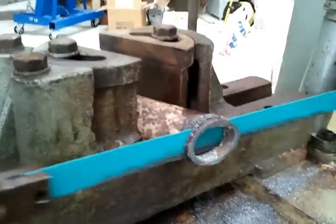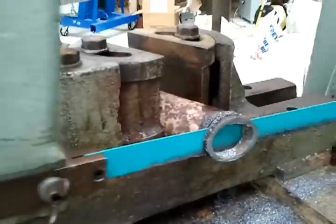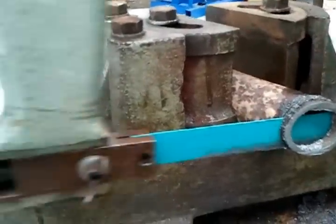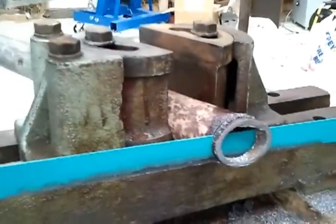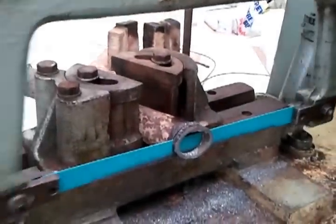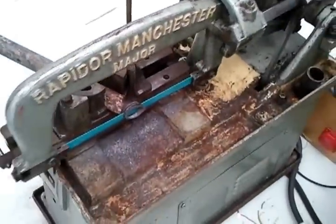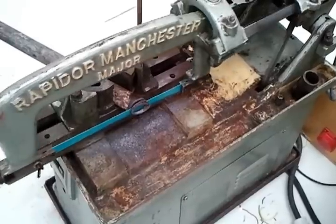It's not actually that slow and it's reasonably accurate as well. The clamping mechanism — I've tried my best to get this at 22.5 degrees but it's quite difficult to adjust the clamps. It's all quite robust, good vice, but really difficult to adjust the angles, so I don't know whether we'll try and rig something else up there. The thing I really like about this is just how quiet it is compared to using an angle grinder or a chop saw.